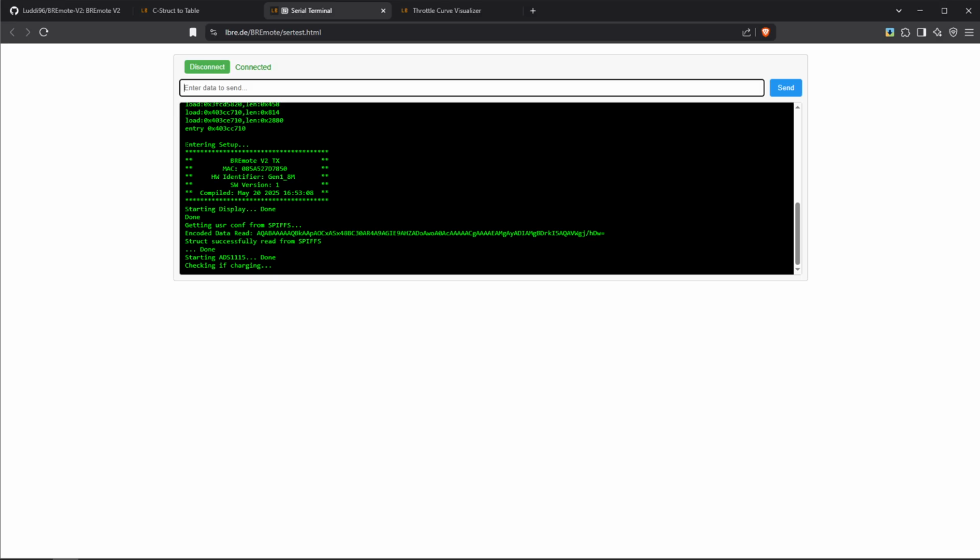So you can see right here, when the remote starts up, it's telling you entering setup, and then gives you a short information about the remote. So we can see we are connected to the TX actually. We can see our MAC address. We can see a hardware identifier. So this means genuine open foil board version 1 with 868 megahertz hardware. So that's interesting. And something you can check if you're, for example, in the US and you get an 8M instead of a 9M, then probably somebody sent you the wrong board, or maybe you ordered the wrong board. Software version, this is just an identifier. For now, we have the software version 1.